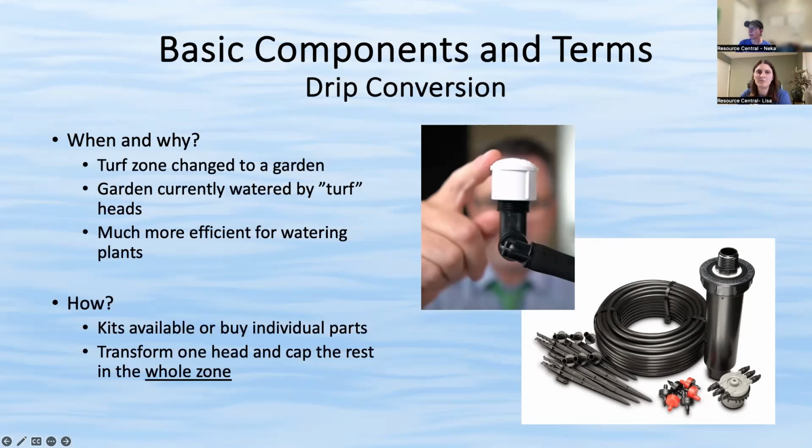And then the other thing we have here is more of a comment for us. And I appreciate this. We had a couple of people chime in about the backflow preventers, basically confirming that yes, those are not supposed to be all the way closed. They should be partially open. Gotcha. Because water can be trapped in there and then freeze in the winter and burst it. So that is why those are not physically closed the entire way. Gotcha. And like we said, we don't really touch the backflow preventers, so that's a little outside of our scope. So I appreciate that.